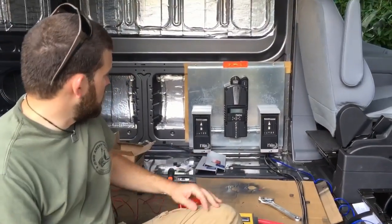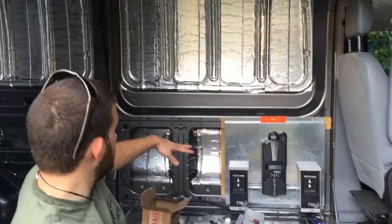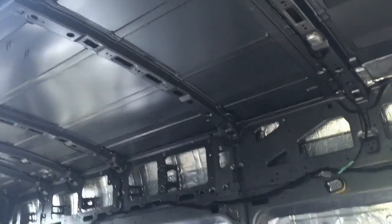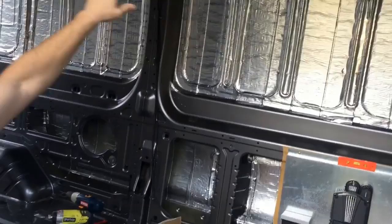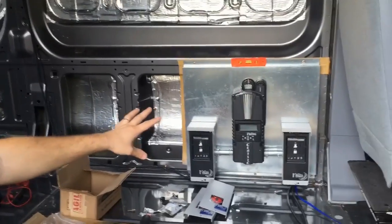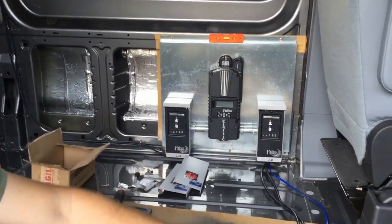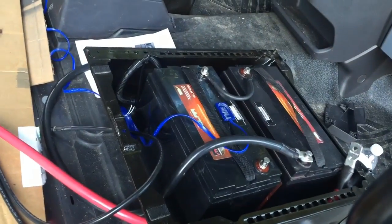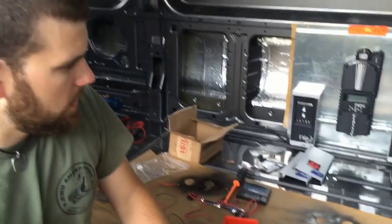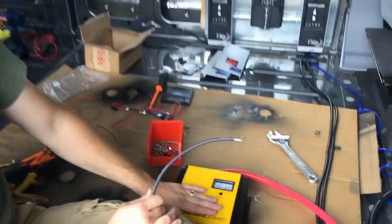At this point in the install, we've got the OTG Midnight 150 board mounted and ready to go. The wire drop comes in through the roof mount — you don't even see it — then it threads through the interior. All this will be filled back in so neither the wiring nor the screws will be visible. The wire drop comes down to this board, which the customer will pull back off, add insulation, and make permanent. We've got our wire cables running to the battery bank; it's a 24-volt system, and this cable will be replaced with a much larger one shipped out to them.